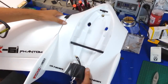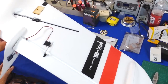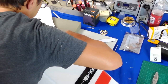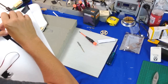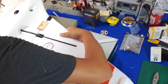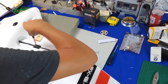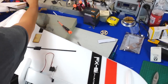Inserting the wings is easy as pie — you just slide the carbon rod into the carbon tube. You need to take something sharp and make a hole right in the middle of that piece of wood through the foam so the screw will go through. I take a 1.5 millimeter Allen key and just push it right through — gives it a nice path. Insert the wing again, super easy. Push it right through and there is the wing retention screw which clasps down onto that carbon rod, securing the wing.